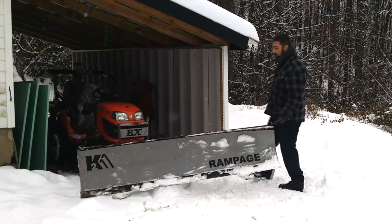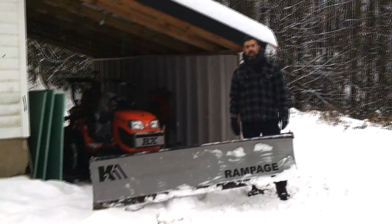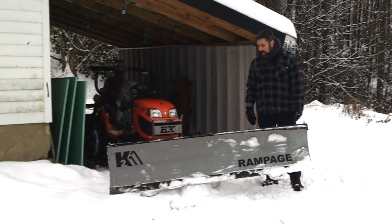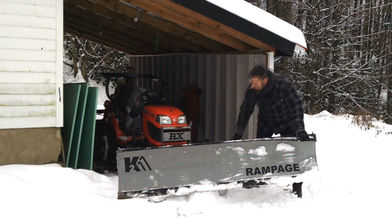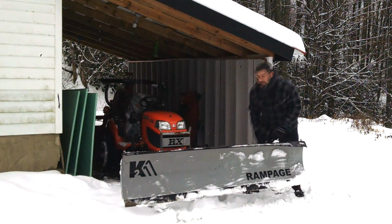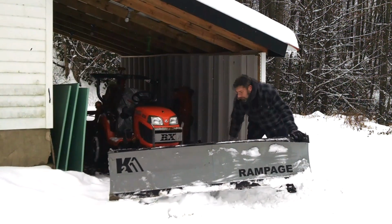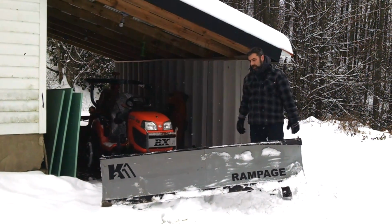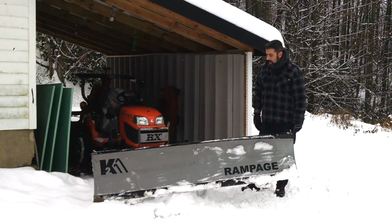Very interesting name for a plow, but it works pretty well. This is a home plow. This is not something you would want to use professionally, although I suppose you could. And instead of being operated off of hydraulics, it has a manual lever for the three positions. Change it to center, left and right, basically through there. And the raising and lowering is done through just a conventional winch with a cable. And it works pretty good for that.